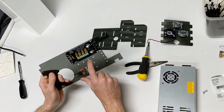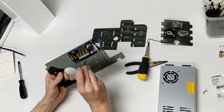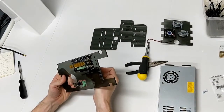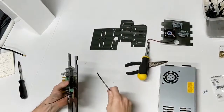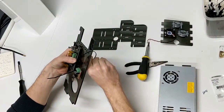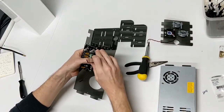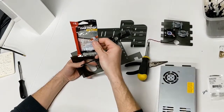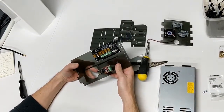Here's the part I want to make sure everybody sees — these pieces here are zip tie holes. The idea is that you can use them to tie your wires down more easily and clamp them to the board. The key is you really want to get your zip ties through those holes in advance, because unless you have extremely small fingers it's fairly difficult to put them in later. The alternative you can do in the designer is use something like a little cable clamp and just create a hole — this is nice because you don't need any extra parts.